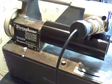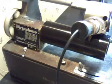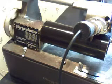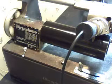I'm going to do a small demonstration of the 1879 Fonda. This machine has the original stylus and original diaphragm. I have of course replaced the gaskets, but it works remarkably well for a very small machine and one without a flywheel. It's certainly much harder to keep a steady speed than with a flywheel, but it does work very effectively. Although it was made with a very small horn, I find that all tinfoil phonographs work better with a recording horn and a reproducing horn to help direct the sound.